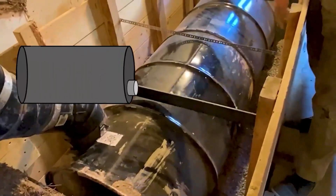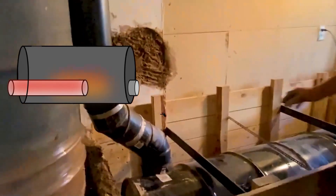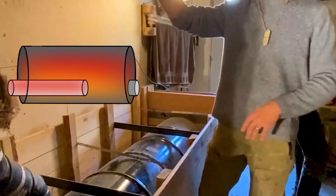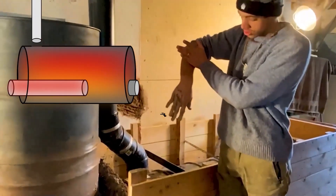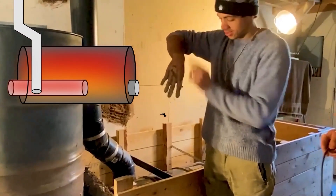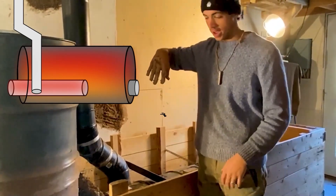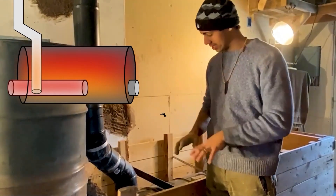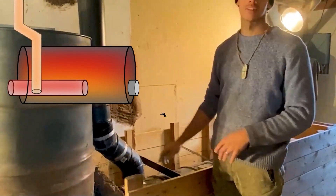The 8-inch ducting is going to about this mark, right about here — that far — making it so we don't have this little stream going up and out of our chimney. Hopefully it has a chance to stratify. Our chimney right here is actually a juice-box style, which means it's sticking way into our stratification chamber up until about three inches from the ground. The idea is the hottest gases are going to stratify up and we'll have a gradient down to the coldest gases at the bottom, and this is going to be sucking up the coldest gases, exhausting out of that place.